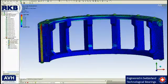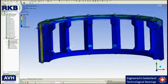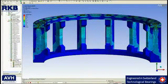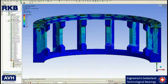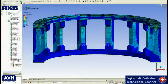Here, the stress propagation through the entire rivet body can be clearly seen. It will reach its maximum value on the interface between the cage cover and the cage base. In the AVH execution, the stress is reduced because the forces are transmitted directly to the cage base structure, where the section is bigger. Another element leading to lower levels of stress is that the AVH cage structure is made only of brass, which has elasticity properties better than those of steel and permits higher elongation.